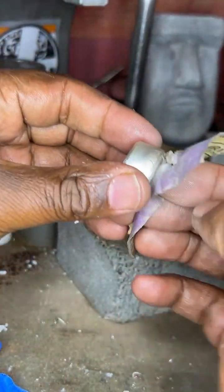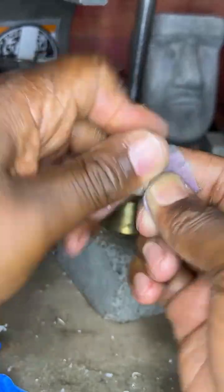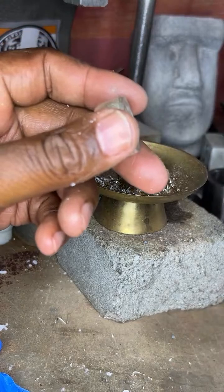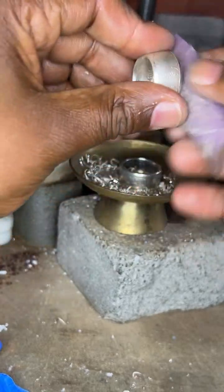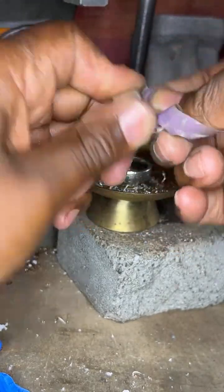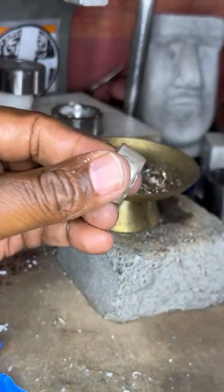I appreciate that. So what I want to do is just keep on doing this because I want to make sure the inside of the coin is nice and smooth. Then I'm going to take that same approach all the way down. This right here is 320 grit. I'll place that right there. Then my next grit will be a 400. Now this is the tedious part. A lot of my friends who make coin rings, not everyone uses their hand. Some people still use machines to clean this portion out, but I still use my hand. I want to feel the metal, right?